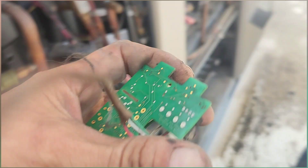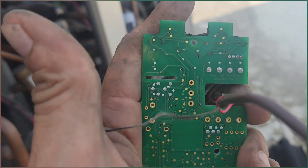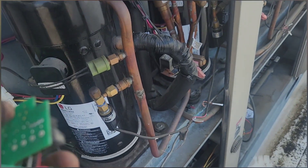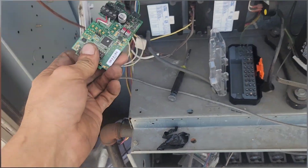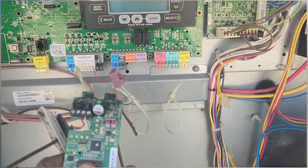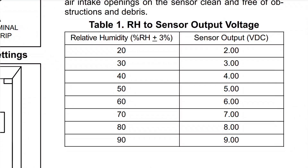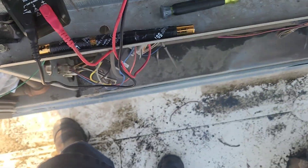Unfortunately this humidity sensor is not working — this ain't no good. I wiped it off but on the back there were burn marks, and this thing is done. I was going to try to get a zero-to-ten volt DC signal back to the board. This board: if I input nine volts to my inputs on this board, it's going to tell the board I've got 90% humidity, as if the sensor was working. I couldn't get it on video because I have to hold these wires.